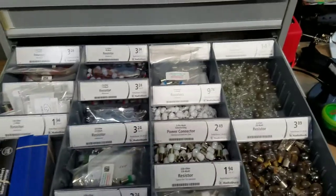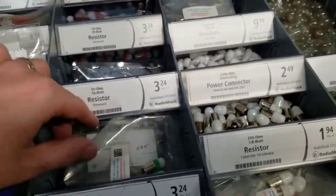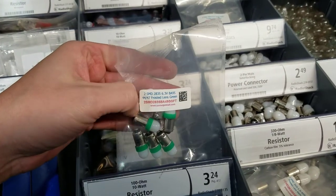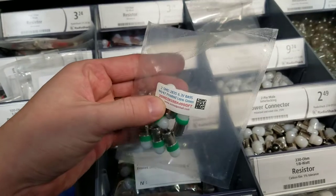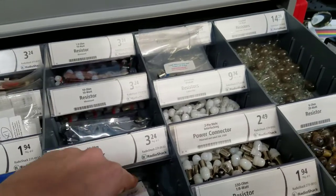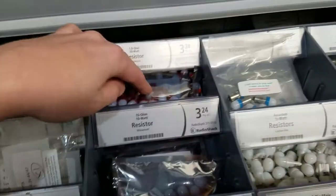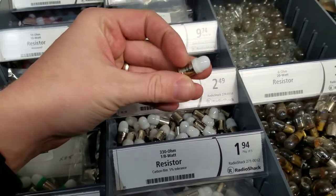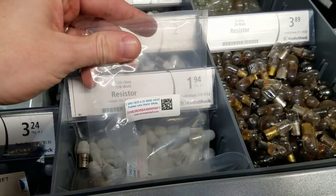My LED bin is what I like the most. I buy all my LEDs from Comet Pinball, labeled by color. I always use the 2SMD 2835s — I believe that's what Stern uses on most new games — with a frosted lens. These are my go-to bulbs available in a #44 or #555 bayonet. I've got greens, reds, ice blue, royal blue, #555 natural white, #44 natural white, and warm white — all the exact same bulbs just different colors.